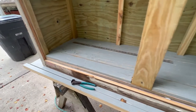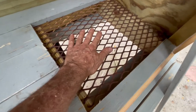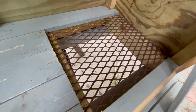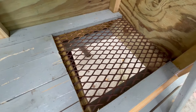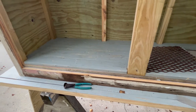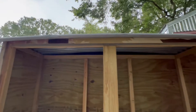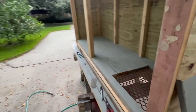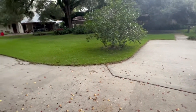Awfully nice of somebody to buy all this treated lumber, paint it gray, and throw it out at the street - framed the whole thing with this stuff. I don't have the floor screwed down yet. I'm going to pull it up and put some stainless steel screen under this vent, because it's going to have a propane tank in here. I've cut a floor from ripped-down two-bys, added the stainless steel screen to keep bugs out, and put some expanded metal to protect the screen. The inside is pretty well closed up but it's just too wet to finish - the plywood is soaking wet and it's rained here every day for at least three weeks.